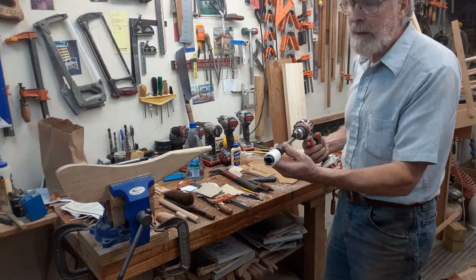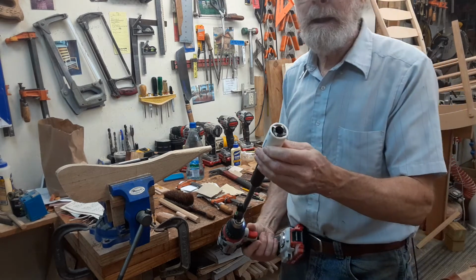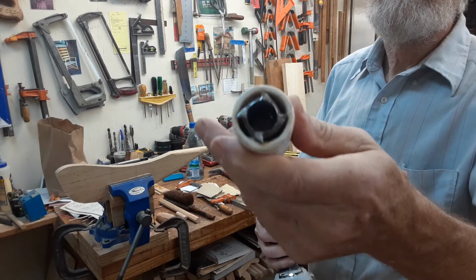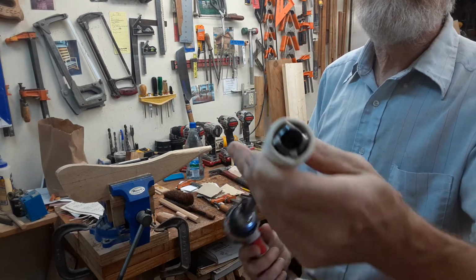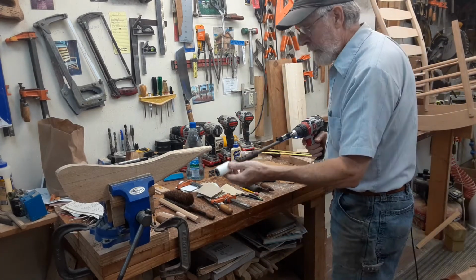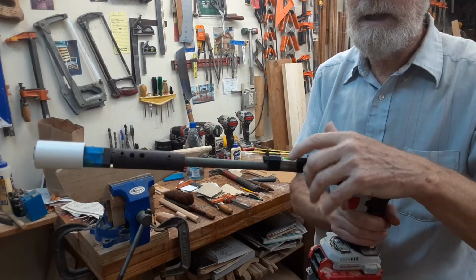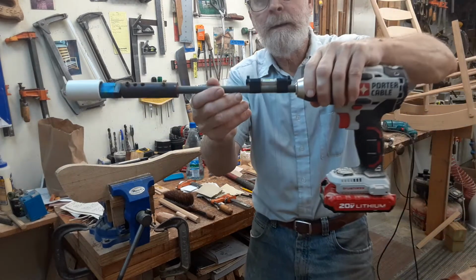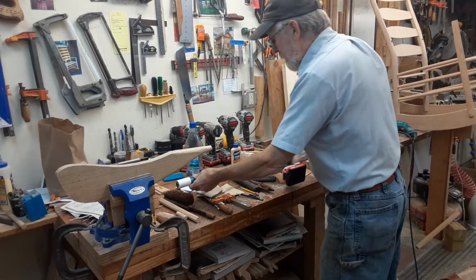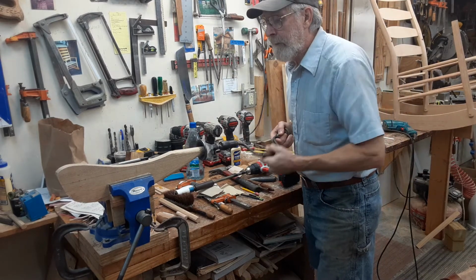And then I'm going to take my tenon cutter. I guess you saw me use it for the tenons on the rungs. I've got a safety thing and everything on it. I've got a depth stop in there. So anyways, the difference now is I've got this long extension with a level on it. Hope you can see that. There's a level right there. First of all, I need to put my chamfer on there so I can get my thing started.